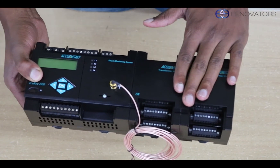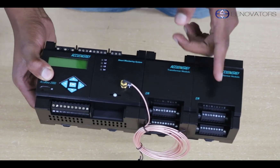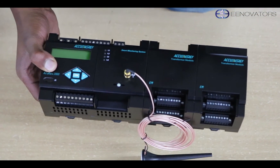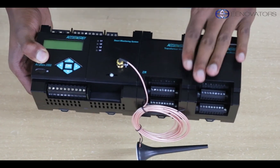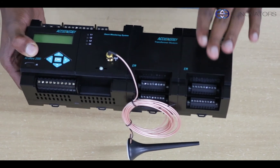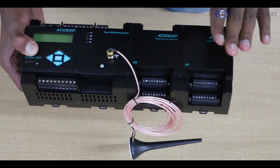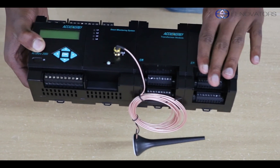The power meter goes beyond basic energy monitoring into power analysis. It will tell you parameters such as unbalance in your voltage or current, and it can tell you about harmonic distortions. It will also monitor energy consumption. It's a great meter for buildings if you need to monitor tenants — tenant submetering. It's great for institutions such as primary schools, high schools, and universities, if you need to monitor how individual buildings or building sections are consuming energy.